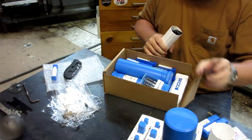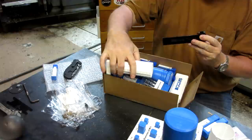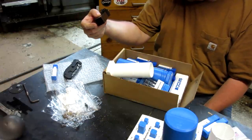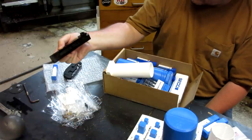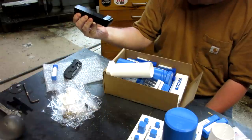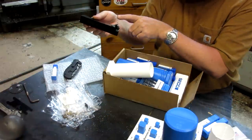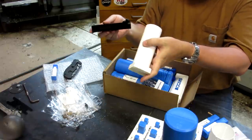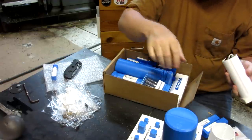Well, there we go with the holder issue. That's a WNMG holder there. I think the standard number here is a MWLNL 16-4D. Very nice. It's a clamp style pin and a seat. So very, very nice. Can certainly put that to use.